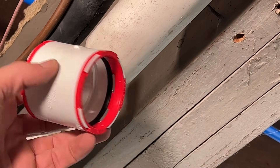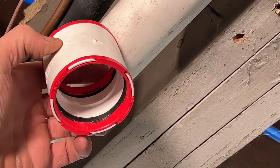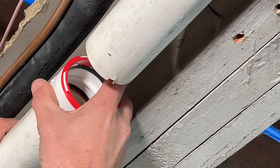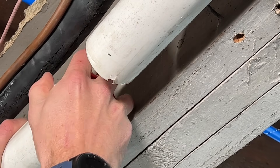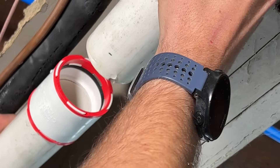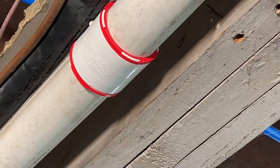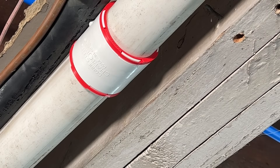Here's the coupling — make sure your O-rings are in the channels and seated. Then without it at an angle, so straight onto the pipe, you'll press and do a slight twist. You'll see that one-inch mark will then go away. That completes option one with the push-to-fit coupling.